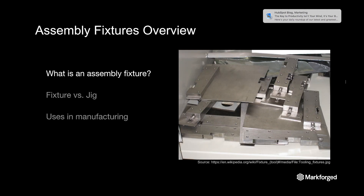Starting off with an overview, I wanted to first establish what an assembly fixture is. An assembly fixture is any tooling or components that are created to aid in the combination of two or more base parts by guiding the tool path or tool across the fixture parts. Assembly fixtures can range from a simple V-block or chuck to highly automated production cells leveraging hydraulics, pneumatics, or electronically driven actuation.